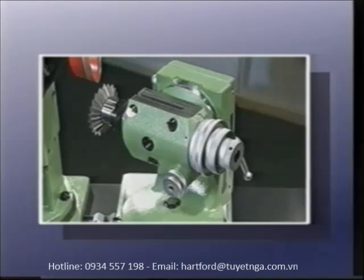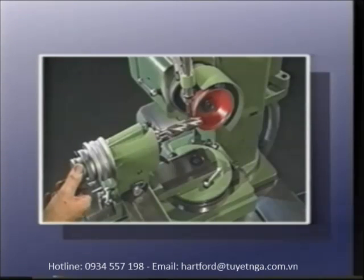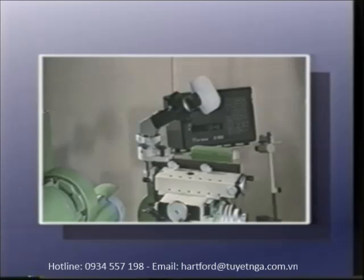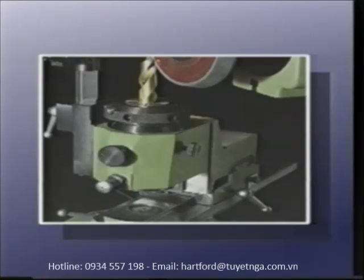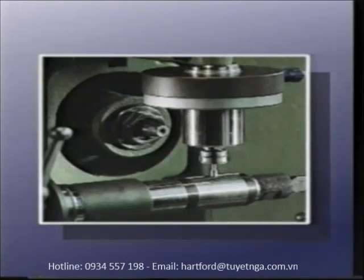The comprehensive range of S11 attachments and accessories enables you to give your cutting tool the correct geometry and a very special finishing touch. A carefully designed range of flexible accessories enables you to adapt the S11 individually to every grinding task and avoids time-consuming changeover procedures. Most standard and special tools can be ground in one clamping operation, and the machine can be adjusted for new grinding tasks with a few easy moves.